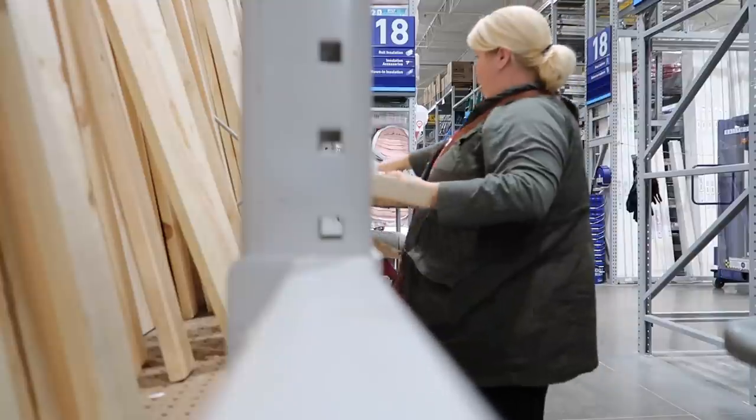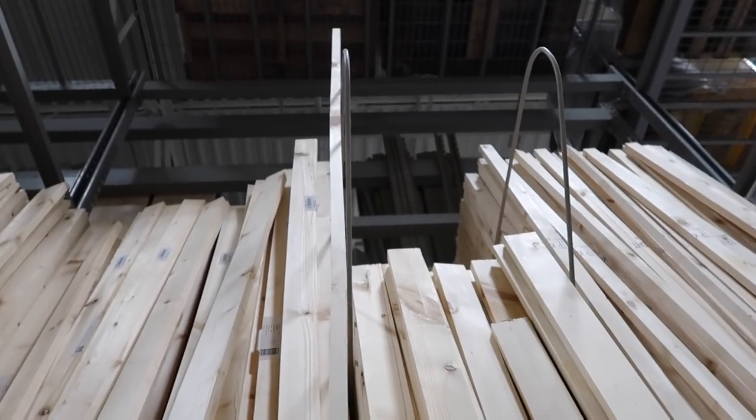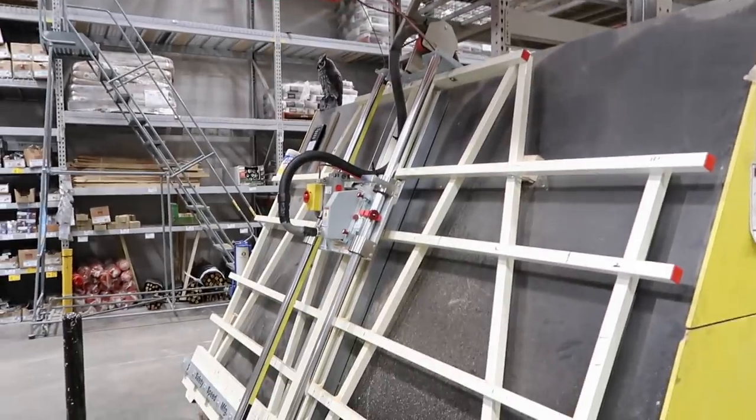I always lay my boards flat on this metal rail here to see if they're straight or not — if they lay flat, they're not warped. I also hold it up and look straight down the board to make sure it's not curved. It really sucks when you get them home and they're not straight. This particular batch of boards at Lowe's were very crooked — it took me some time to find a few that were pretty good and straight. This is a project you can do even if you don't have saws at home; they will cut it for you at Lowe's. I have three eight-foot boards here and I'm going to have them cut into four feet. I'm looking for an employee to cut my wood — it's a service they provide, but there's never anybody back there to do it.